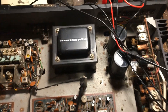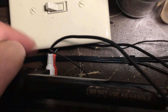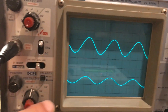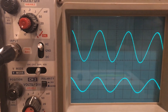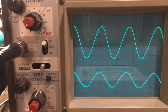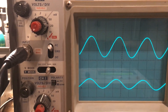Right now I have hooked up the scope on the input. I put an AUX input right here and the signal shows on the scope, actually on the right-hand side over here. There's a weak output here. No matter how much you turn up the volume, it always shows the weak output on the right channel.